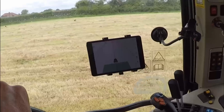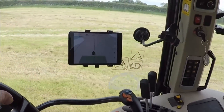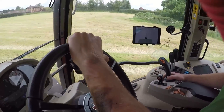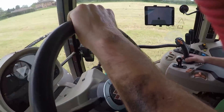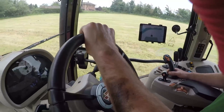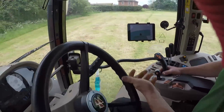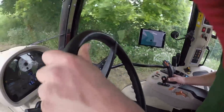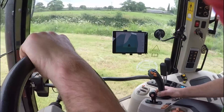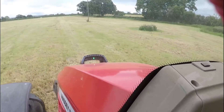Once you start running up and down the straight work of the field, as you can see on the iPad there's a line to follow. That is your AB line, and the black lines on the screen are 18 metres apart. You can see it's painting behind where we've covered. As it's set at the minute it's always painting, so when we're turning on the headland it thinks it's counting up. You can turn it on and off but there's no real need to - it's just wasting time. You can see on the screen we're approaching the headland again. Shut the spreader off but the line keeps painting, then aim for the line on screen again and get your green light down on the bonnet.